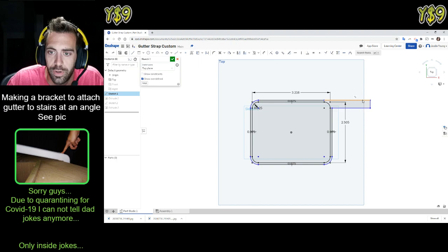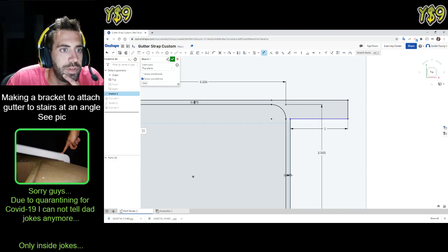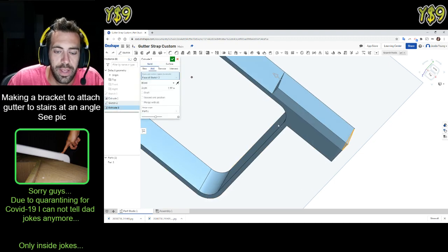And this is just a rookie move here. I probably should have dimensioned this and just given it something. It's close to 1.5. Let's call it 1.5 inches. That's a lot for a tab there. Let's back it off. Let's call it an inch. Will save us on print material. All right, cool. And then that auto updated, but the blind did not. So I've got to edit this.